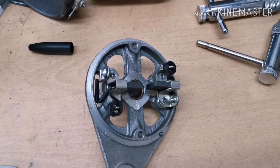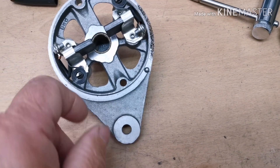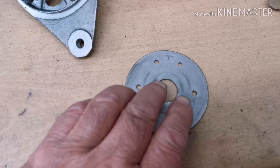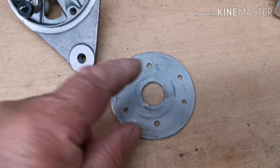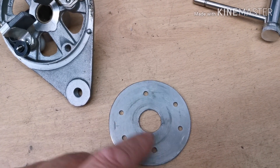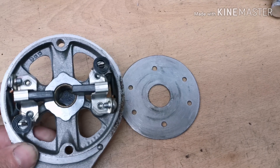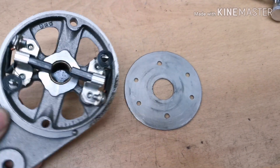I've decided there's too much work involved in trying to machine that down - besides, the brushes would be in the way. I thought if I'm going to take them off I'll make a new plate. These two holes will be for fixing it inside the casting, and these two holes here will be for each brush. So I'm going to start taking the brushes off of the original.